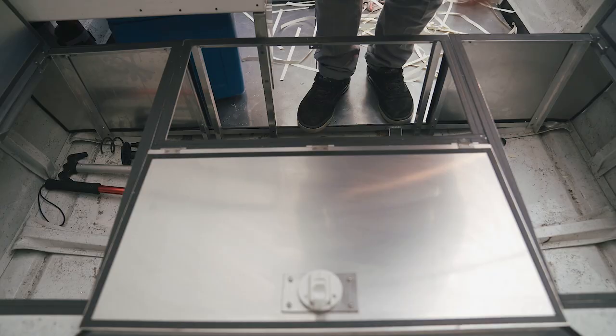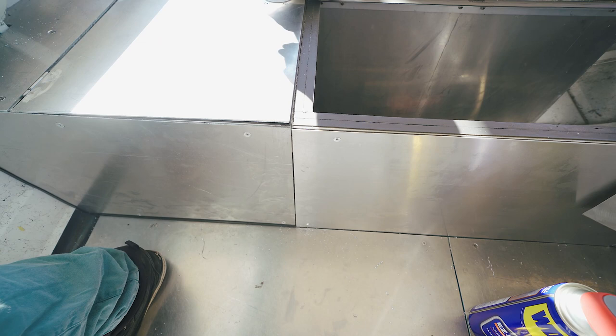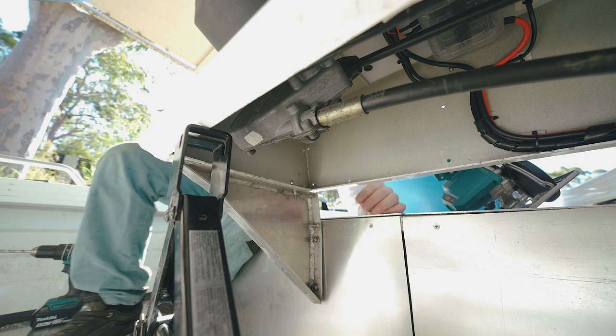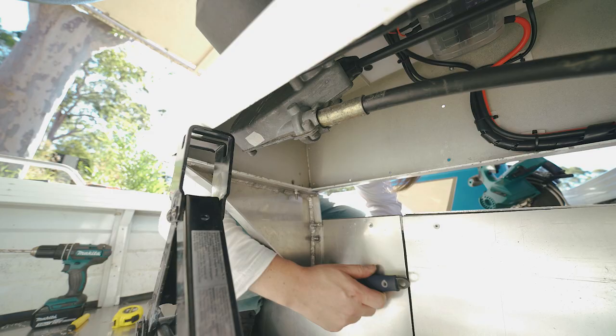The final step is to install the center kick panel into position, as well as securing the console gusset through the kick panel to the vertical upright. The best way I found to secure it at the perfect height was to use my car scissor jack — elevating the console slowly until it was level with the deck and then cinching everything up with stainless M6 hardware and nylock nuts. And that's how I piece together a totally custom, home built, aluminium, lightweight, bass boat inspired, super awesome and functional casting deck.